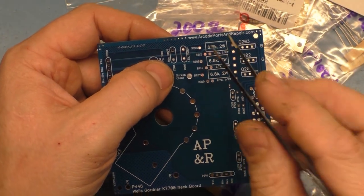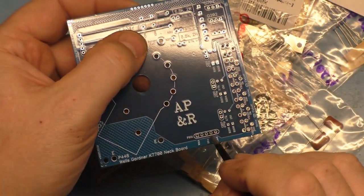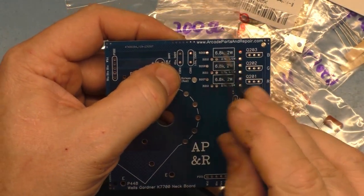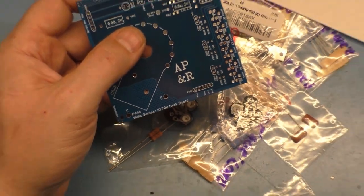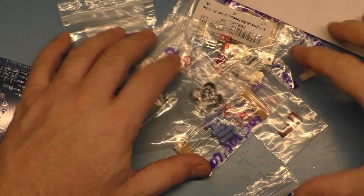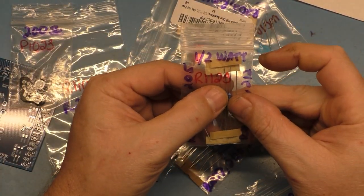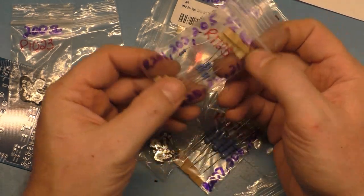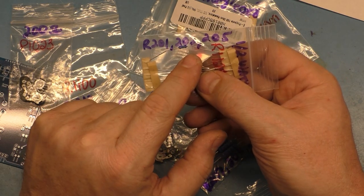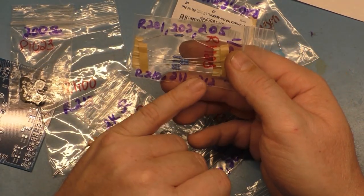So other than the part number for this pin for the G2 wire and the part number for the headers for these two connections, everything I list down below will be everything you need to build and stuff this together to get it to work. Okay, and there's one more thing before we start on this. R1125 here corresponds to R201, R203, R205, R210, R211, R212.